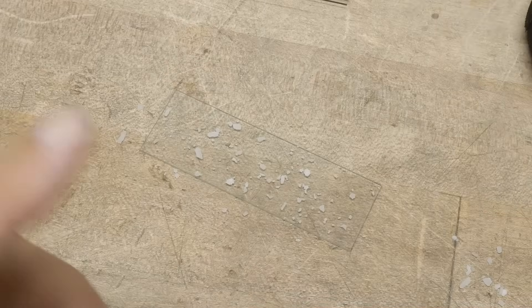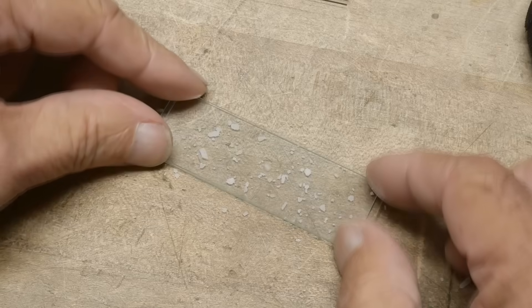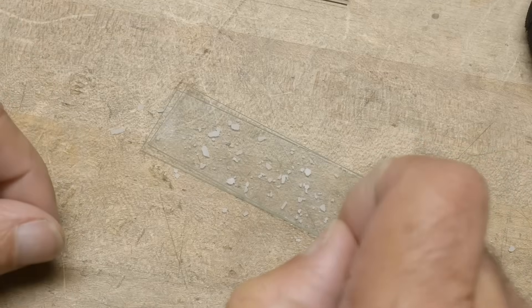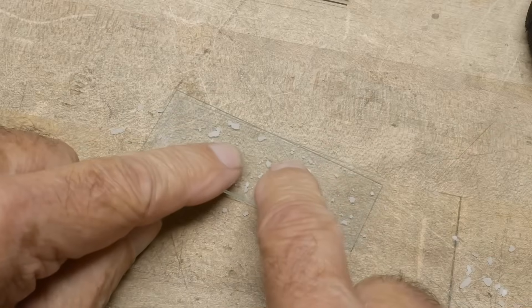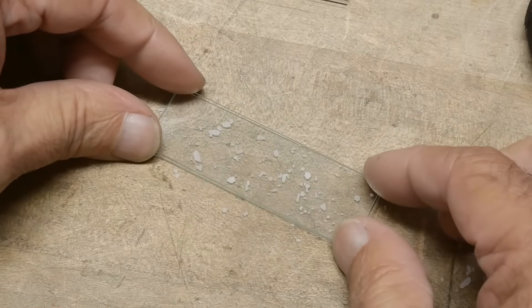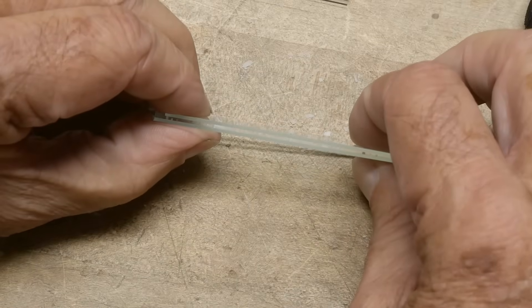So how do we put these two pieces of glass together? Here's the magic — we're going to put salt. This is big coarse salt just so it photographs well, but imagine you put some material — not salt, but something like little ball bearings or little glass beads — that are exactly the same size. Those little glass beads would hold everything perfectly the same distance everywhere. Then you'd glue down the corners or the sides, and those little particles would hold the two pieces of glass exactly the right distance apart.